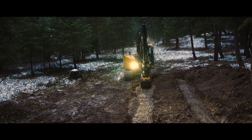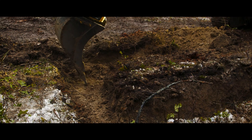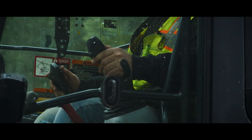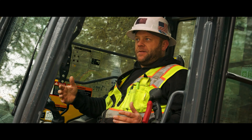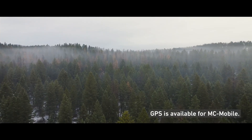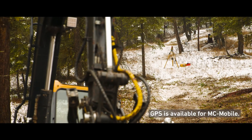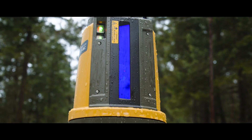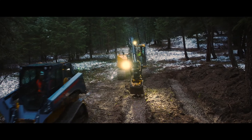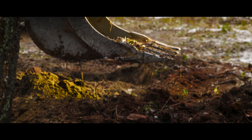As long as you have a clear line of sight from the prism to the LN150, you're able to run with a couple hundredths of accuracy. A lot of people are familiar with GPS systems — it's kind of similar to that, except you don't rely on satellites. Around here we deal with all the trees and rock cliffs, but with the LN150 it's a direct line-of-sight machine to the total station or rover pole, giving much tighter tolerances. You have the built-in capability of 2D all the time, and later you can add LPS or GPS functionality.